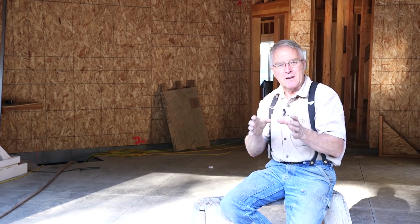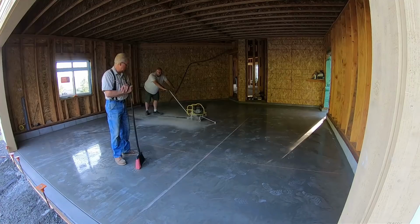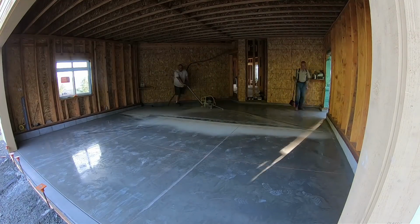First, because the plastic shrinkage is happening immediately. As soon as you put it down and that hydration starts, the concrete starts getting smaller and cracks are starting to form whether you can see them or not.